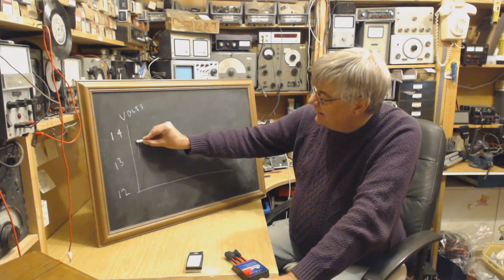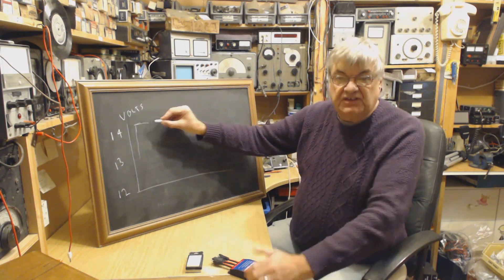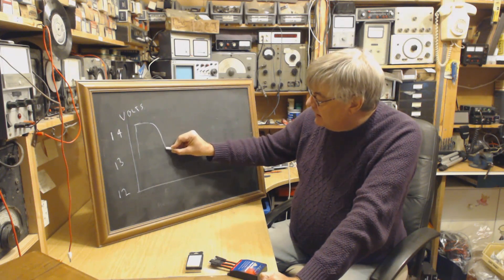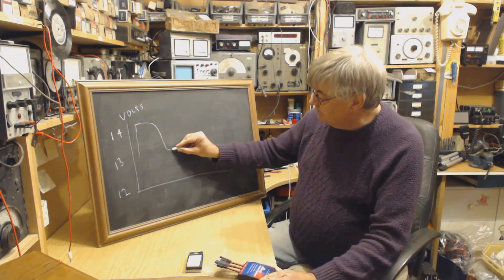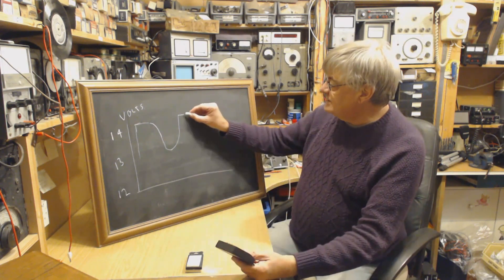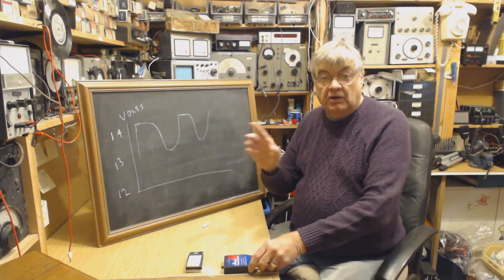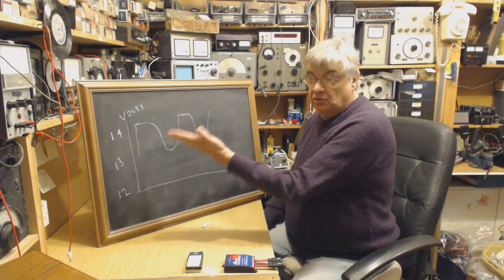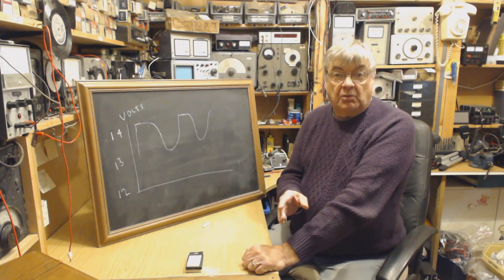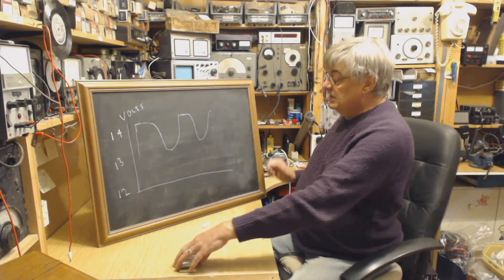Your battery volts go up and up and up, get to about 14.5 volts, and that switch is off. Now 14.5 is artificially high because charging has held the battery volts up. So the volts very quickly drop, and as they come down, this switch is on again. It gets back up to 14.5 and it says battery's charged, turn off — then down again, battery's flat, switch on. I watched the ammeter: 0 amps, 5 amps, 0, 5 — like windscreen wipers. This thing is switching on and off constantly, and as I read somewhere, your battery will never actually reach full charge. The best you'll get is 70, possibly 80 percent charge — so that's no good.